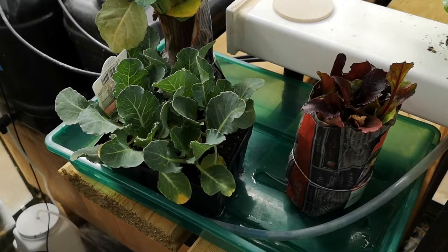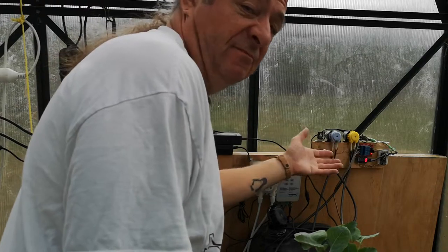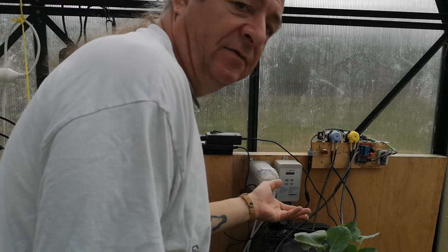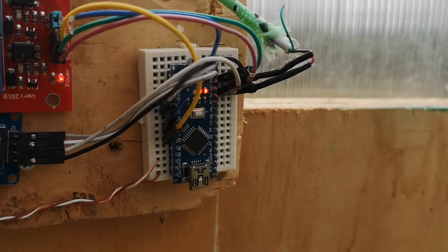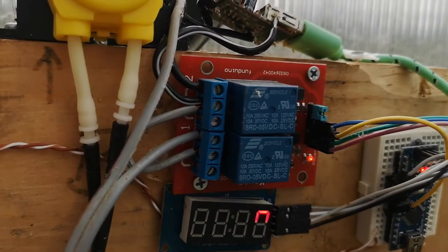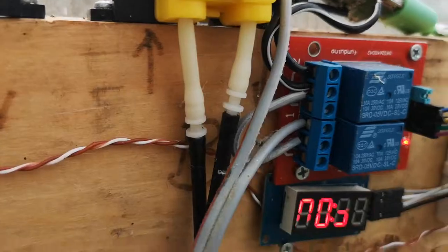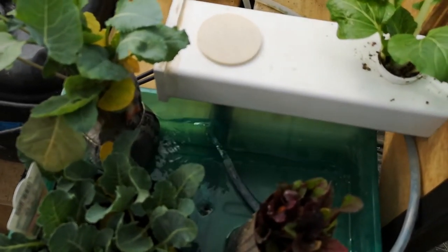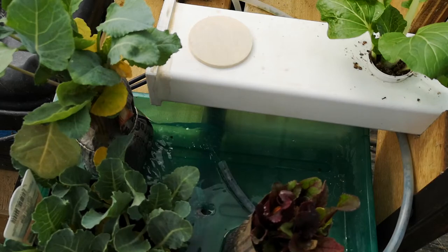It's quite simple, really. We've just got an Arduino down there which counts four hours, turns the pump on for about a minute, then turns it off and counts another four hours — and it'll just keep on doing that. Very simple code. We've got the little microcontroller in the middle, a relay board which turns the 12 volts on and off for the little motor, and a display at the bottom for those pumps. And there it goes, filling up the tray with water. See that little drain hole in the bottom? That will eventually drain the tray, but it fills up a bit first.